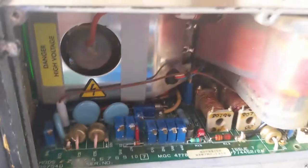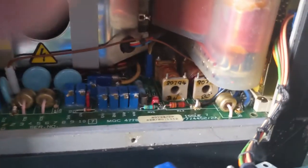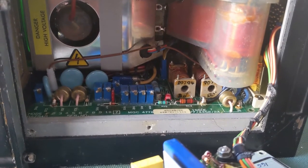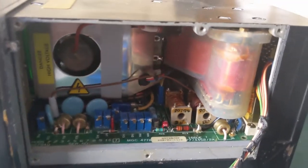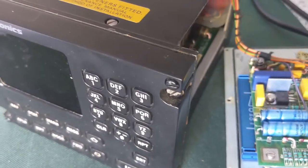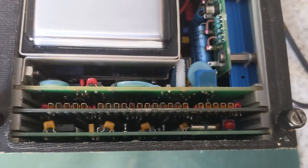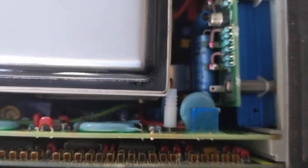A quick look inside. I've done some waveform captures on the back panel as well. It appears to have a line scan frequency of 15625 Hz, which is the same as a PAL TV, although clearly it's not a PAL video signal going to the CRT. Here's the front cover removed — three circuit boards. Here's the CPU board there, video processor board there, and that's obviously the CRT scan board. I say it's got a 15625 Hz line scan rate, which is quite interesting.